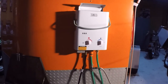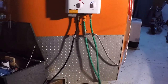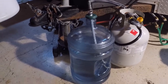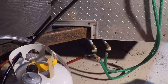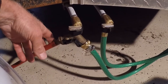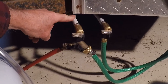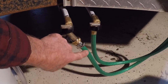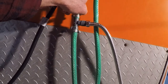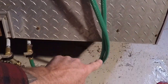Here's the view that I thought was in the frame when I was showing you how this thing worked, but it wasn't. Those lines go down here — there's my water, there's my tank, there's my cold and hot water inlets. Cold in from the pump: this one goes into the trailer to the sink — you can see that part in my previous video — and this one feeds the heater as the cold water supply. The hot water supply comes down, tees off to the shower, and also goes into the trailer.